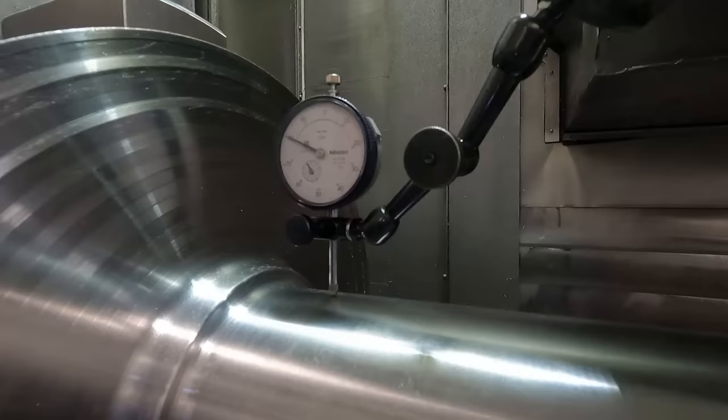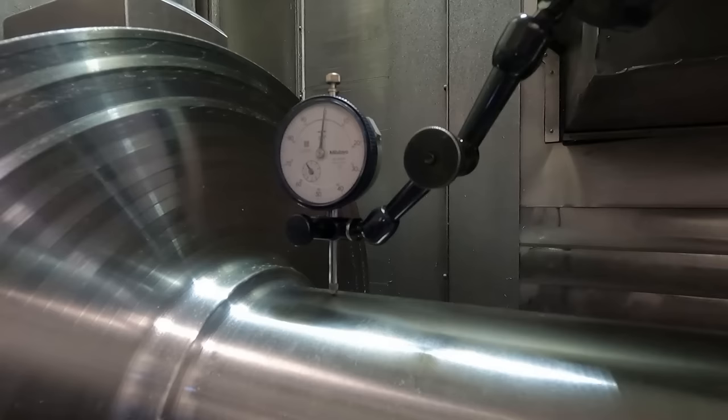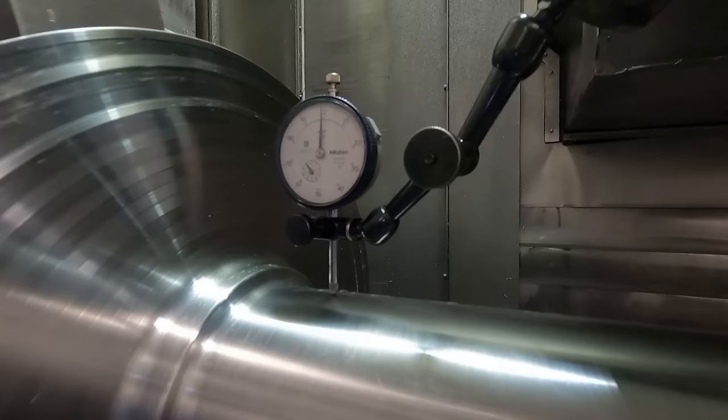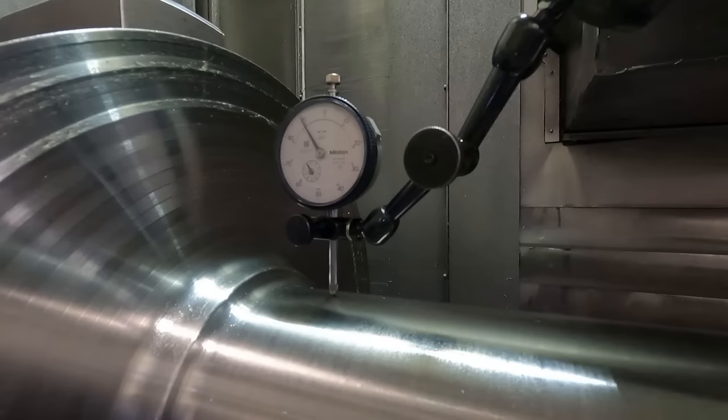As I said in videos before, I'm gonna get the indicator on the high spot here, and I'm gonna zero it on the 100 thousandths on here and the zero on the big needle. I'm not gonna worry about anything but the two jaws 180 degrees apart from each other. So we're gonna rotate around 180. I'm gonna see where we're at. See, we're not too far off, only 10 thousandths. We got to come up, but in this case